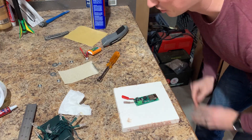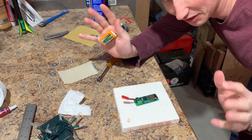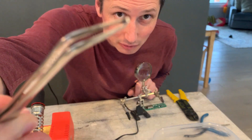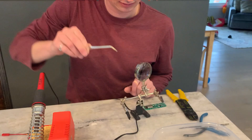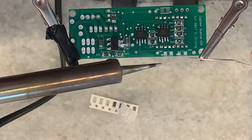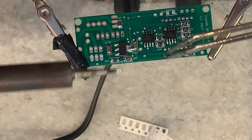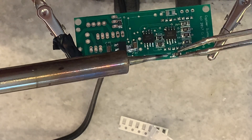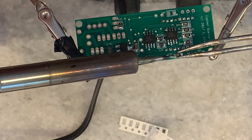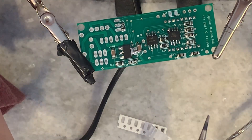Look at that — excuse the workbench, but I just finished assembling the Egg Timer Quantum. It's probably the most advanced electronic project I've done — a lot of surface mount components that are really, really tiny. For surface mount work: pick them up with your precision tweezers, position them trying not to be too shaky, then hit the other side with solder.